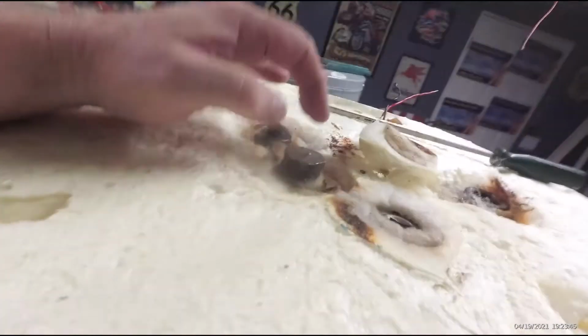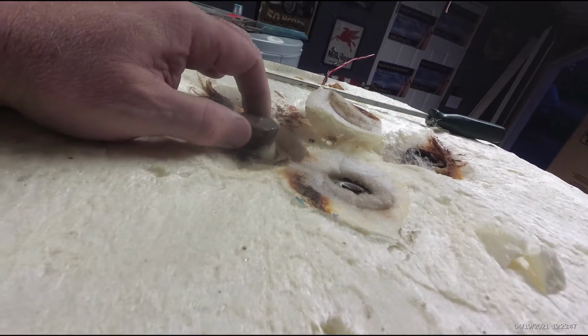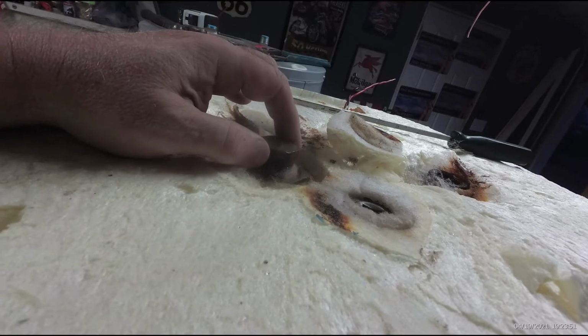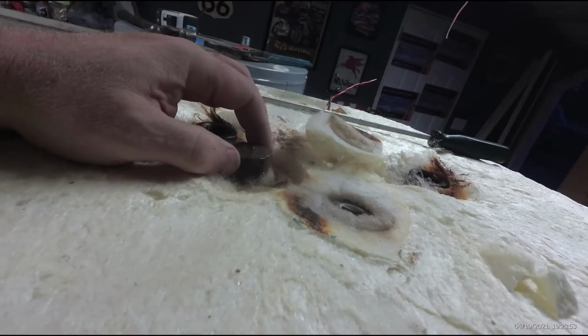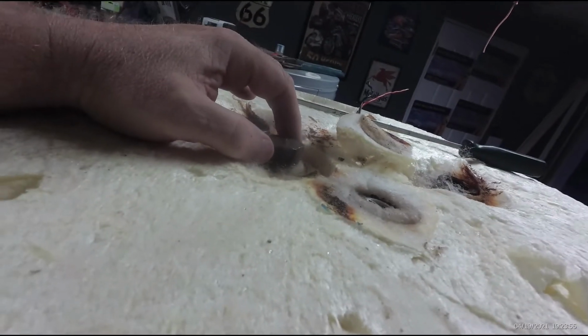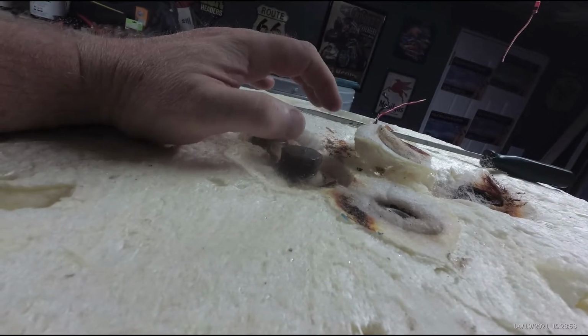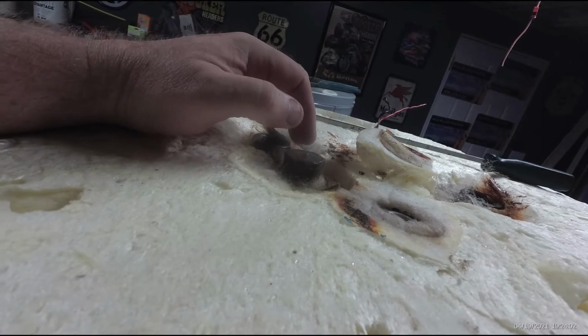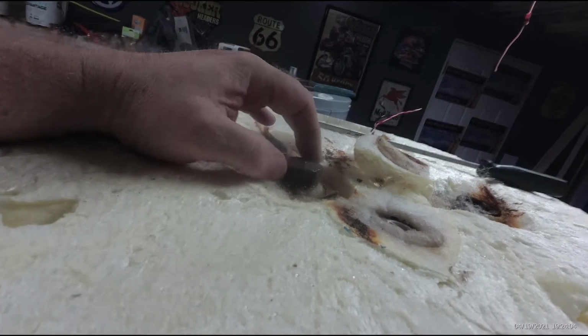Let's take a look at this. This is the anode rod. This is what they blame on you. This is your part. You should change this. At least check it every single year. I've got it loose. And you really should. If you want your water heater to last, it's on you to make that water heater last. If you can't do it yourself, get a service contractor to come in and inspect your water heater every year.